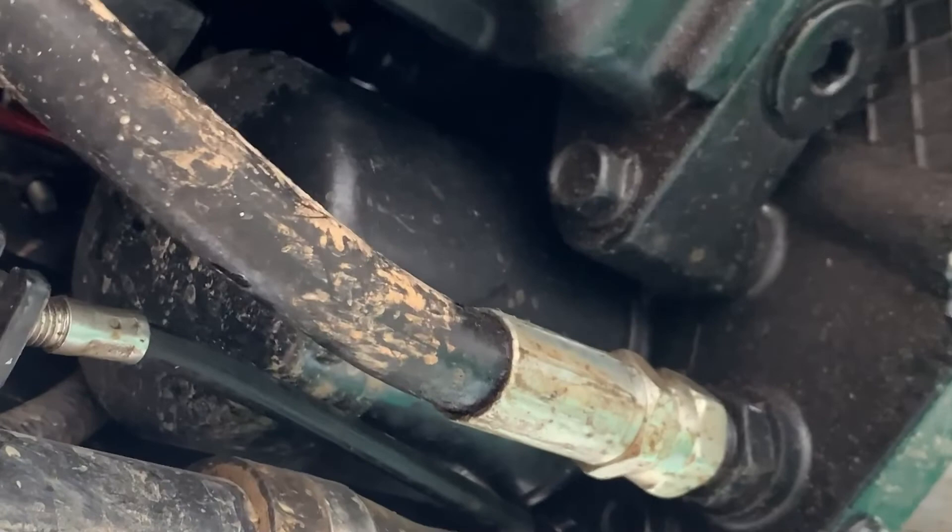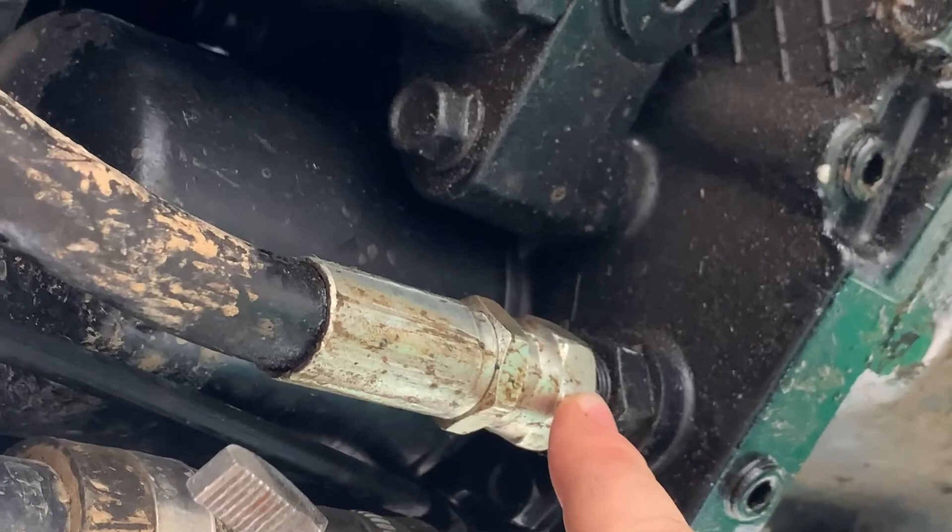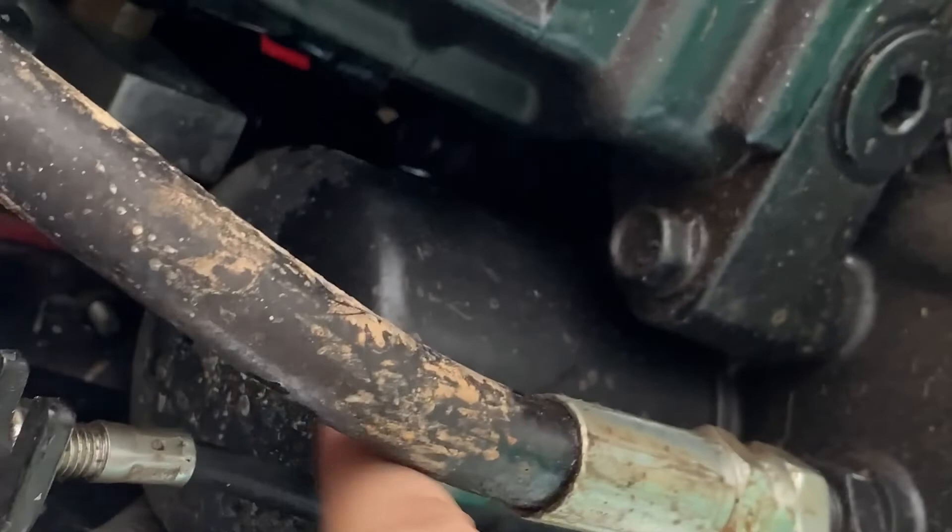Easiest way to do it: if you can be careful, this hydraulic hose can come off. Since you're drained and everything, you shouldn't have much coming out of there. A good little pair of channel locks — loosen her up, take it off there. Then you can fit either an oil wrench or a large thin clamp wrench, something like that. And just, this is where the patience comes in — little bitty turns until it comes off, little bitty turns until it comes on.